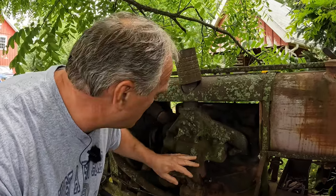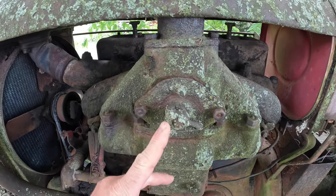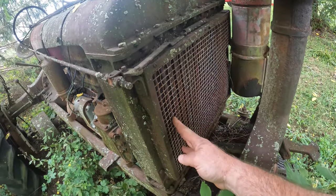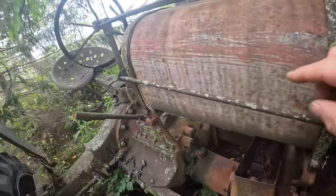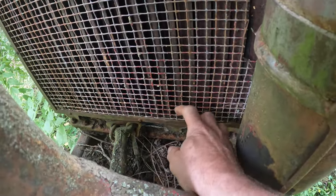It's really hard to find one of these manifolds that isn't cracked, and this one is cracked — not as bad as I've seen some of them. This lever right here was connected to a rod that ran straight back into this holder, and this rod controlled how much you were pre-warming the air — it regulated how much exhaust air was passing by the intake air so you could sort of adjust the temperature. That heat exchanging manifold worked in conjunction with these radiator shutters in the front of the tractor, another method for keeping the engine running hot when it was running on distillate. These shutters connect to this linkage that runs back to a crank here to open and close the shutters. These radiator shutters are quite a bit more rare because when people converted them to just running on gasoline, they just took them off and threw them in the barn. They also tend to rot out on the bottom because debris collects down here. These are in pretty good shape.